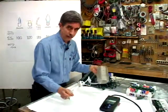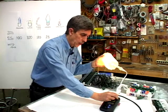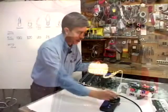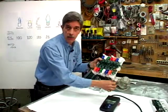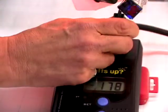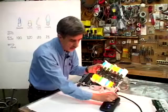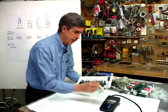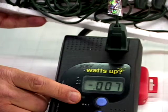Another kind of LED light that offers a lot of illumination are these tube lights. You can see there's a lot of variety in stores around town. This had the rating on the box around 67 watts, and that's what it's showing right here. We've got about 100 bulbs on this strand too. Now, in a larger bulb like this — you see these outside a lot because they're a little bit brighter, a larger bulb, maybe more resistant to the weather — being a larger bulb, they're going to run a little more wattage too. It's going to run about 178–179 watts per strand, and that's only 25 bulbs. And then you might have some specialty lights like this. Generally they don't use a lot of wattage — ten little bulbs like this are using about 7 watts.